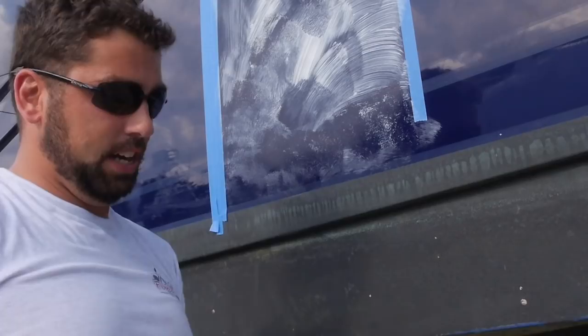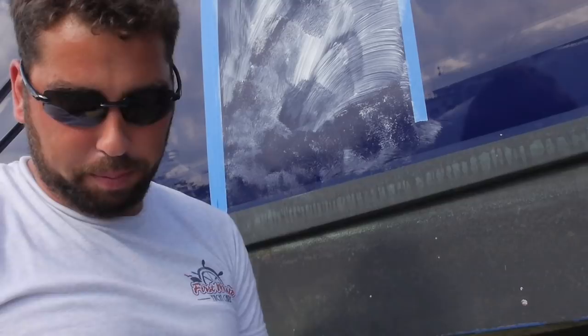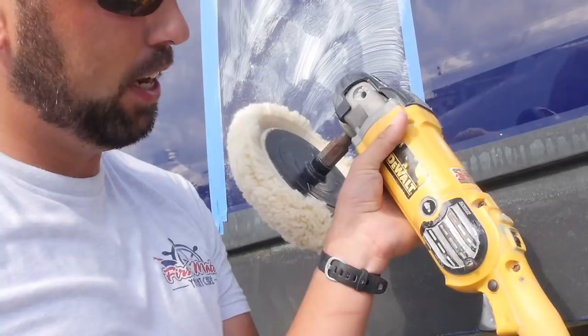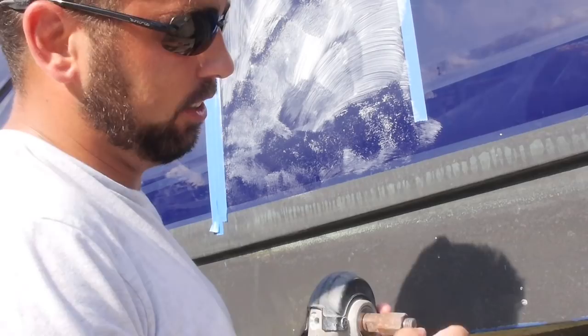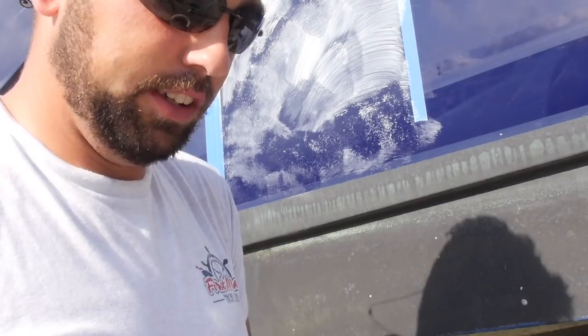As far as buffers, we have the DeWalt DW849X, as you can tell by the sophisticated grille guards so wool doesn't get in here. This is actually a brand new pad — I probably shouldn't do this for a video because it is going to be spitting wool all over the place. It's got the little rubber guard, which is an upgrade from the previous 849. This buffer has been beat up a little bit, but she still works. These pads — this hook and loop wool — we just bought a Makita and it came with it. We typically use the threaded pads, the double-sided. You would screw right on there. That's a short shank adapter so you can screw on the pad and it doesn't go all the way through. You don't want the spindle to hit the boat. That would be bad.